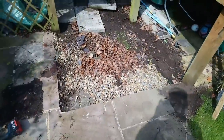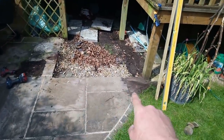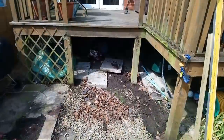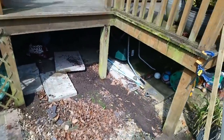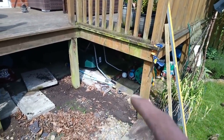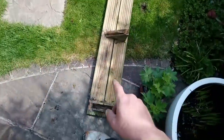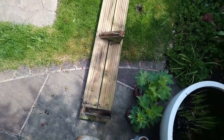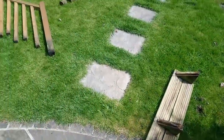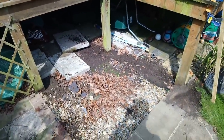Now I'm just going to be sitting on top of these flags. It slopes away slightly so I'm going to work to this side and I'll just have to cut that one a little bit. Steps and stairs are all about the going and the rise. Those stairs I took out, they're only little skinny timbers — 120s. I'm using slightly wider boards, 147 to 150, something like that.